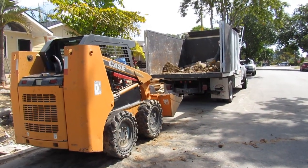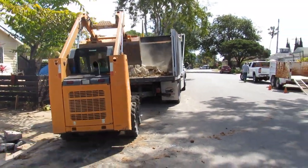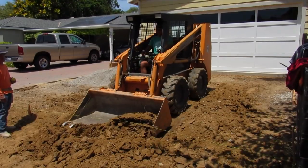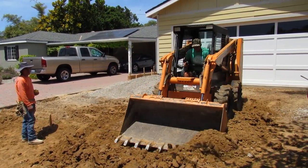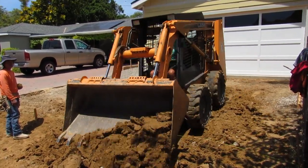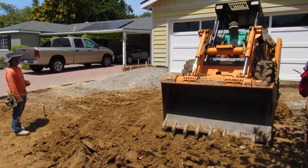That size dump — I'm just throwing it in there. I have my dump trailer here because I'm hauling the dirt. You've got to go six inches down on the dirt, and I don't want to go up on the street with the dirt and make a mess, so I want to stay on the property and load it. This Case has got a pretty high reach, but if I brought my dump truck I wouldn't be able to reach because I'm going to be 12 inches down once I dig it out — but I can load the dump trailer.